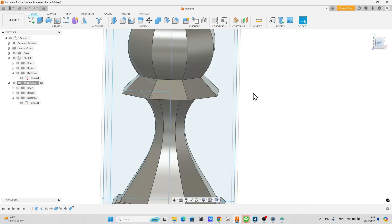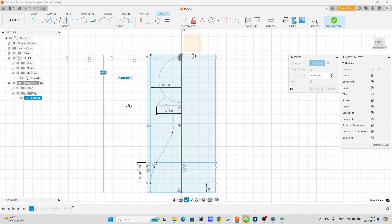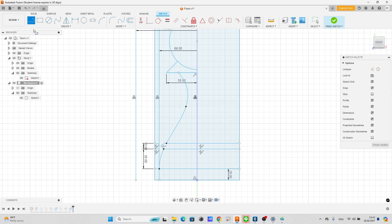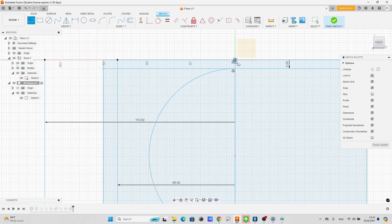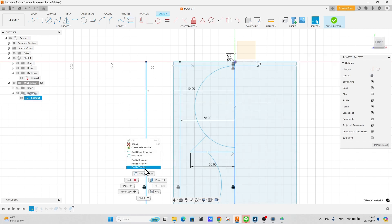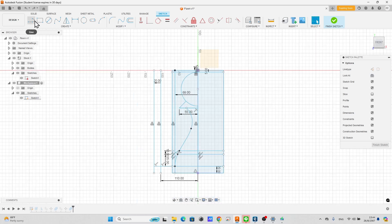Click to edit the sketch of the workpiece. We will create a guideline for the cutting tool to move outside the stock. Offset the center line at a distance greater than half of the diagonal, which is 216 millimeters — so set it to 220 divided by 2. Draw a line to force the cutting tool to move above the stock at 10 millimeters distance.